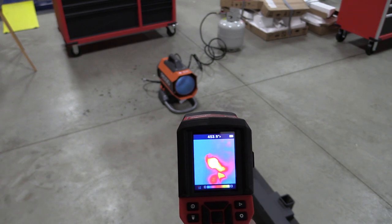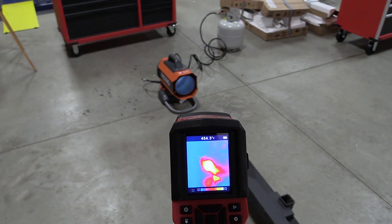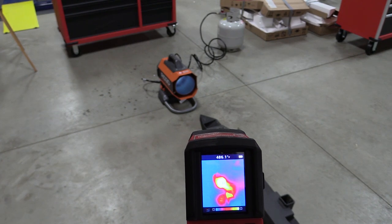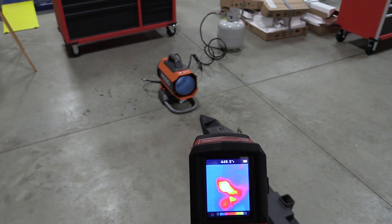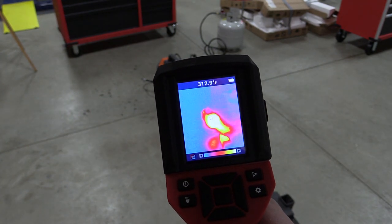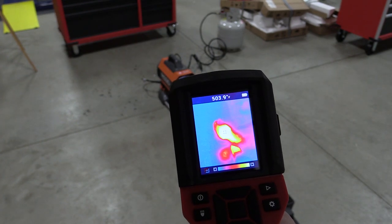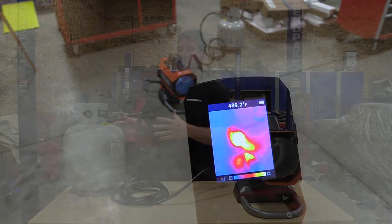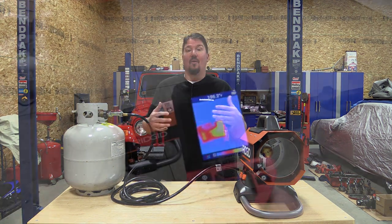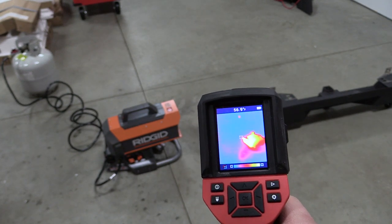While you're using this, make sure that you have it pointed in a safe direction. The air coming out of this is very hot. We put a bumper in front of it about two feet away, started this unit up, and let it run for 15 minutes. We were checking the internal temperatures in and around this unit — inside we were seeing well over 500 degrees. After we shut this unit off, after 15 minutes, that bumper was over 200 degrees. So if you have it pointed towards something like a fuel cell, something that's plastic, or a wall, you can burn things down or melt stuff. Be very, very careful with that.